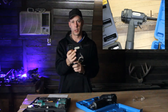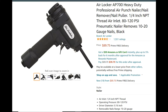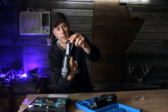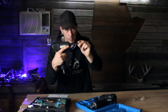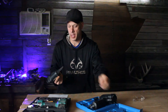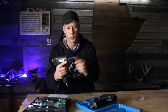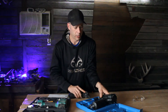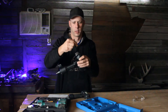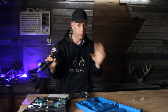The Air Locker — this is the smaller of the guns. This would work really well if taking apart pallets, those nails are a little bit smaller gauge. The thing is, on the end of them, you want to be able to fit the nail inside — that's key. Because if you can't fit the nail inside, the gun's not meant to take that nail out. What's going to happen? We've done it, not knowing originally, and you blast out the side of this gun — especially this little guy, because this is almost aluminum. Versus the next two guns, which have a metal shank where the nail slips in — this is all metal, and I'll explain why it's handy to have one metal, especially for bigger nails.